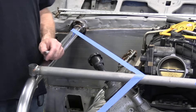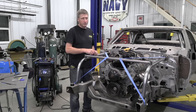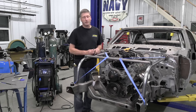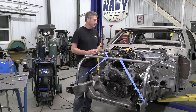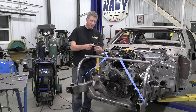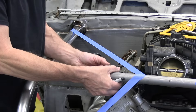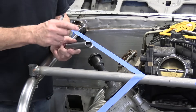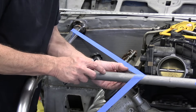Next it's measure my angles and my overall tube lengths, which is pretty easy when you use this special patented blue layout tape. I took my protractor and measured the inside angle here — I came to 35 degrees. I did a test cut on a piece of tubing and it turned out to be a little bit too much, so I dropped it down to 34, coped it again and that came out just right. So now it matches that angle.